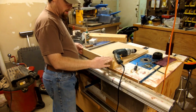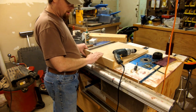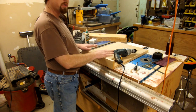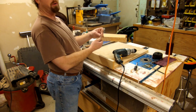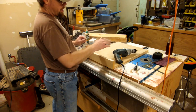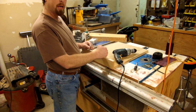We're going to go ahead and attach this back plate here to help stiffen it up and also give a good 90-degree reference. Right now I've just got it tacked on with double-sided tape and I'm going to drill some pilot holes, then use one-and-a-half-inch pocket hole screws with a coarse thread since we're going into plywood. Now that I know where my blade mark is I can make sure I avoid putting the screw in the path of that should I accidentally go too far with the bandsaw.